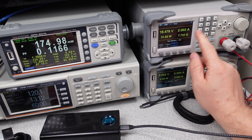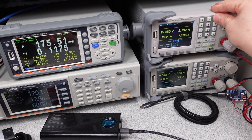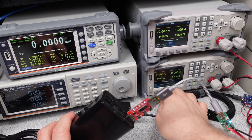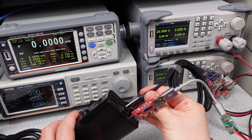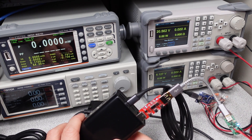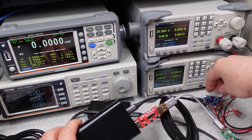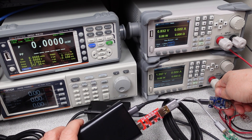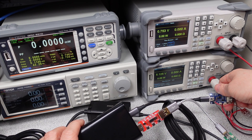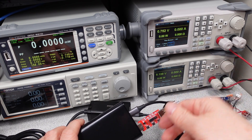This should be able to do 5 amps at 11 volts, but I'm not sure if the protocol is implemented exactly as needed for super-fast charging Samsung devices. On every plug and unplug, the power delivery does renegotiate. Plugging in a USB-A device will cause the USB-C to renegotiate, and the same goes for the QC-capable USB-A port. Charging seems to be disabled when any outputs are enabled — this power bank does not have any pass-through capability, so one mode only. This obviously means it can't be an uninterruptible power supply either.